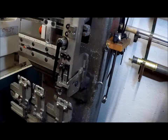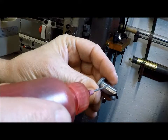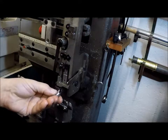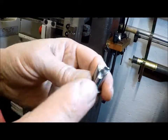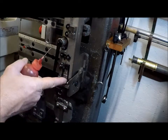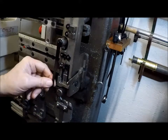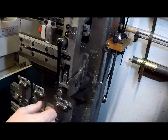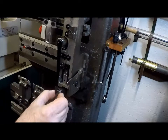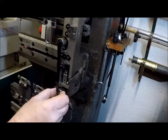Get yourself some good machine oil, put one drop on there, wipe it around, make sure it's good and lubricated. Also put a little lubricant on the ramp here, and make sure there's a little lubricant on the driver — this piece back here — because those two pieces rub against each other. Put it back together, make sure that you can pull it and let it go and it goes back in all by itself. It's natural and it goes all the way in. If it's getting sticky, you have to determine what the problem is and correct it.